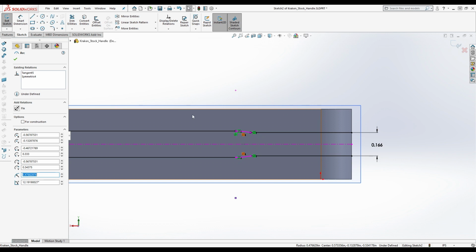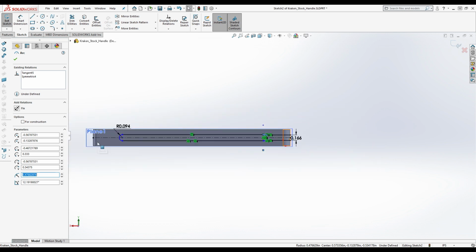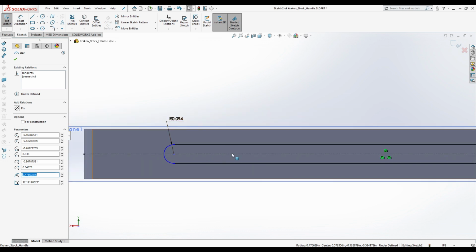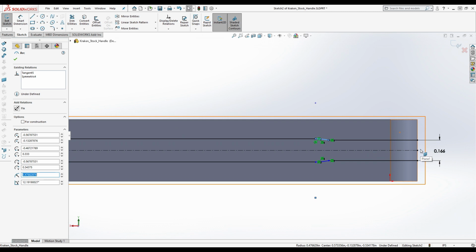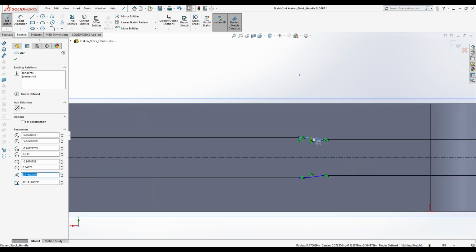The reason is when you're doing a deep cut like this slot here, you want to have as much rigidity as possible. I understand that there are trade-offs with this, and so you might use an eighth inch tool or something, but you would generally want as rigid of a tool as possible. And so you're going to be using as close to the width of the slot as possible, so you can have the most rigidity on that tool and as little tool deflection as possible. And so you are going to want this to be...